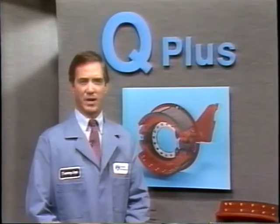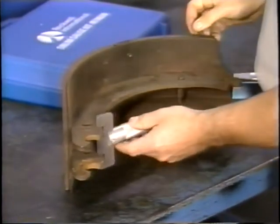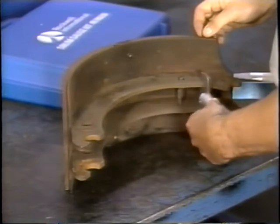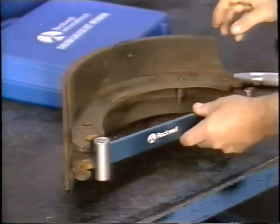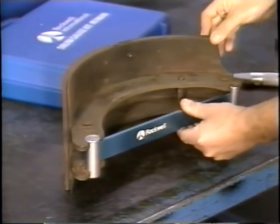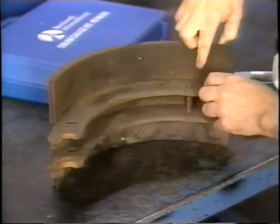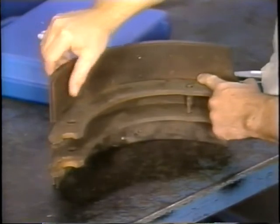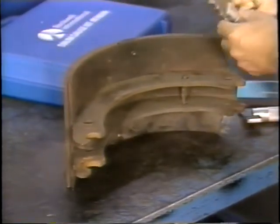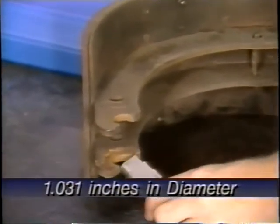The next component in a major inspection is the brake shoes. Begin by checking them for spread webs at the anchor pins. Check the stretch of the shoes between the anchor pin and cam ends — the distance from the center of the anchor pin hole to the center of the roller hole must not exceed 12.765 inches. Continue by checking for broken welds, rust, expanded rivet holes, and correct alignment. The anchor pin holes must not exceed 1.031 inches in diameter. If any of these conditions exist, replace with a new brake shoe.